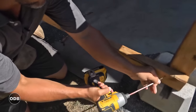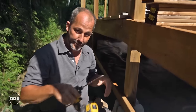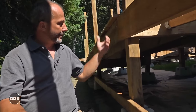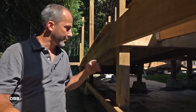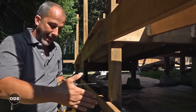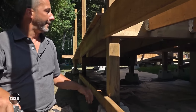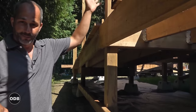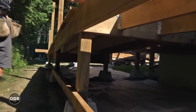Because this is a floating deck, the block is going to interrupt. There are only two options when using a floating block: one is you attach your posts and structure and build out four inches before bringing a skirt down, but that limits your four-by-four posts to surface mount rails only. I'd rather sacrifice a little bit of design and have the block showing so I have safety — I want these four-by-fours attached at the rim joists at the bottom and at the top rail so they're a proper safety element.